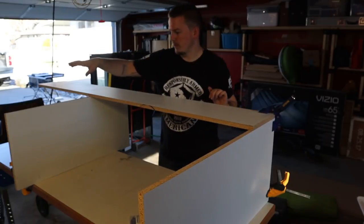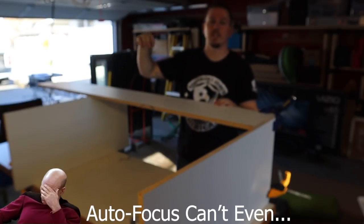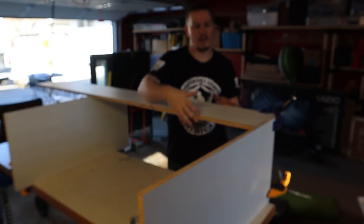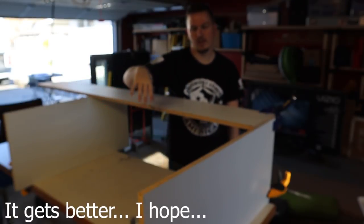We've got all of the shelves cut to the same length — 10 of them plus the top, and four sides. I'll put all the dimensions in the description. I'm going to do this one open-sided, or semi-open-sided, so you'll notice the sides do not span the full length of the shelf. These are 10-inch segments front and back, so there will be a gap in the middle of about 15 to 16 inches, which is really for weight and cost.